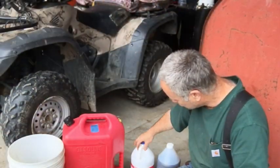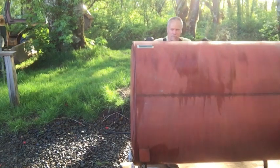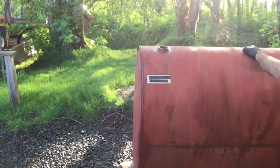was left in there, I went ahead and left the ball bearings still in the tank. I put in some muriatic acid, washed that around with the ball bearings inside there. The ball bearings rocked back and forth and basically scoured the bottom of the tank. That helped out a lot.